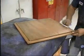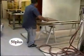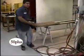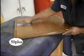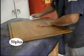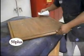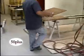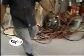When we're done with the oil-based stain, we apply 3 coats of vinyl sanding sealer. And we prefer the vinyl sanding sealer because it has a higher solid ratio than regular sanding sealer. And it's the same with the top coat. We apply the high solids pre-catalyzed satin lacquer. This is good in areas of bathrooms, kitchen cabinets, and we use it basically on mostly all the antiques and the furniture that we do.